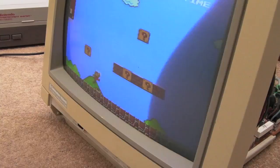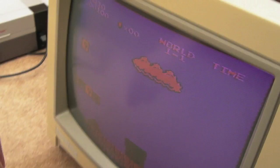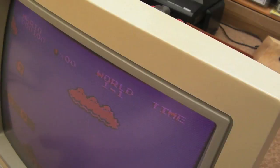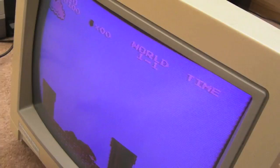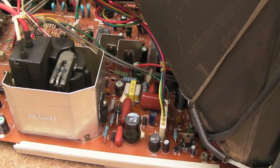After freezing them, can you see we've got a different colour scenario going on - so one of those caps is faulty. We've got a purplish sort of tinge now instead of that green tinge we had before. The green screen works alright but look at that - see it's purple. You can see how I was testing it there, soldered on the underside here, but it just made it easy to swap them around, because I wasn't 100% sure whether I'd got them mixed up again once I took them off. I did it on that side just to assist easy removal and testing. I'm not sure what these are - the capacitors look like maybe they could be tantalums or something. They've got a designation on them, a little line that points towards this side, but I'm just not sure about the size - I might have to see if I can find the service manual or something.